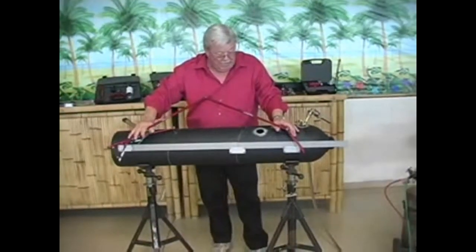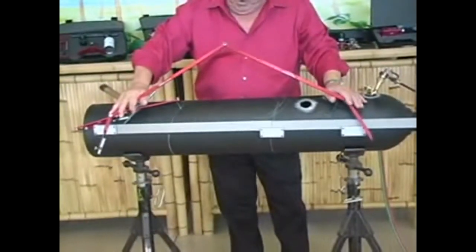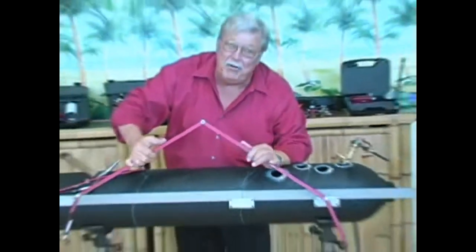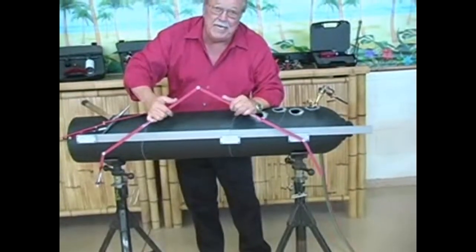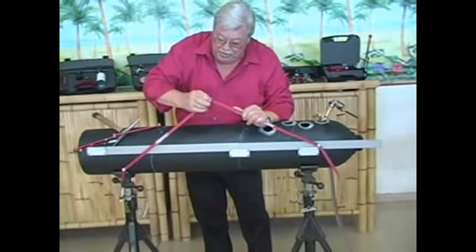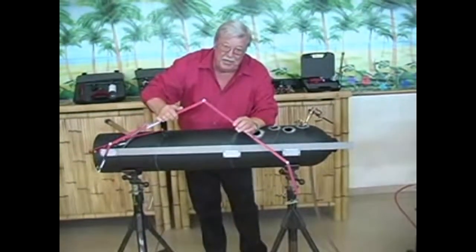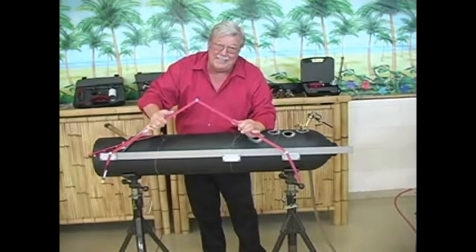Next we have our extra large that goes up to a 100-inch circle. This one is also made to lock in the center, because there's nothing more aggravating than getting out to a real long radius and the center moves on you. A welder actually called me on it and said you need to lock that center. So, you know, we do listen to you guys out in the field. We've made it so you can lock this center and mark your radius and it never moves on you. And this concludes our structural steel layout guides.